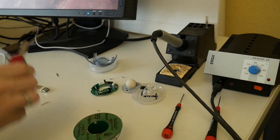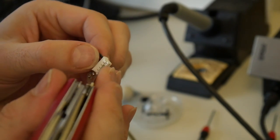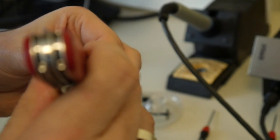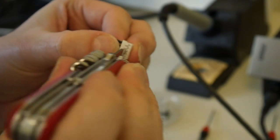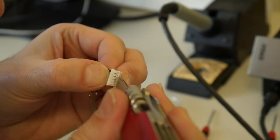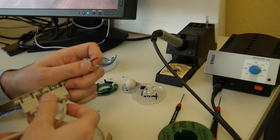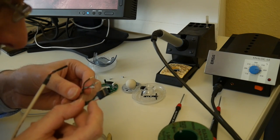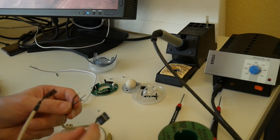So this previously crimped one, I free here with this pocket knife by lifting up these plastic noses here. Which obviously, as usual, works way better without filming it. So I think the two in the center were data. When I measured with this I/O thing here from an old PC, the two working ones were the two right ones, which matched here with the colors. So I guess I will try to just use a color coding from this.